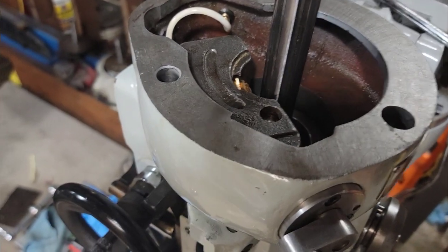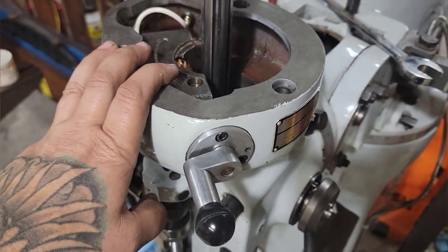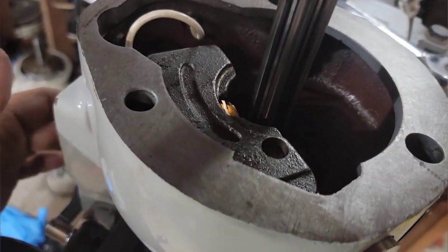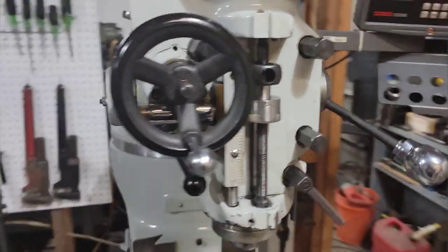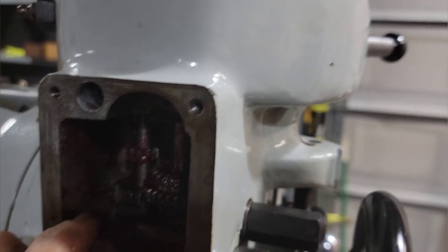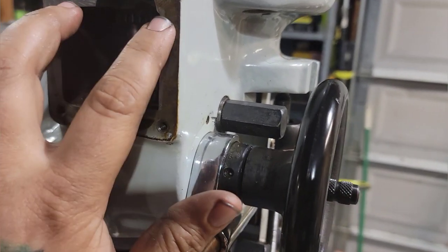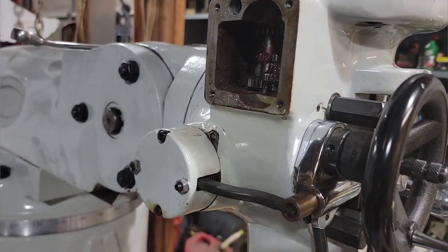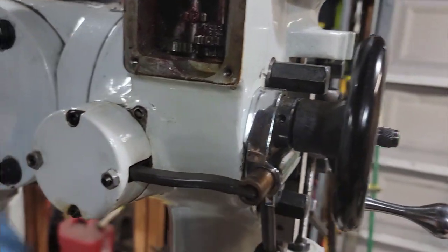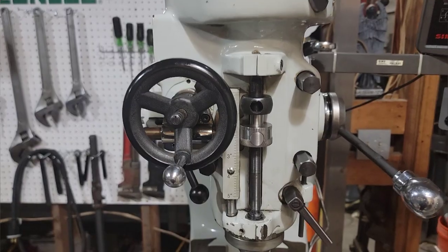So next step: the back gear housing needs to make it to the top but it needs cleaned out a little bit first. And once that's on, the bull gear is the only part of these heads that should really be greased - everything else should be oil. That being said, I did put a little bit of grease on my down feed gears because it doesn't look like there's a lot of opportunities for that to get oil, and I'd rather have a little bit of lubricant. I'll probably run it for a little bit and then pull this cover back off for the gear selector and see how we're looking - see if it's getting oil.